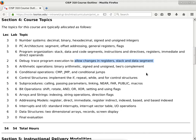So we boil everything down to basically just gate operations. Whenever you look at a high-level program and go, oh, I don't understand how this instruction works, why are we continuing execution back in the earlier place? Just execute it slowly. Figure out that we are changing register A to be a particular value, and then that value in the end ends up in the program counter, PC. When you look up the processor architecture, you can see how the program counter hooks up to the address bus, but you have to switch a few things first so that it controls the address bus. That's the reason why I am teaching the class the way I'm teaching it this semester.